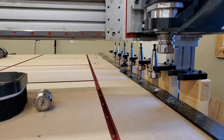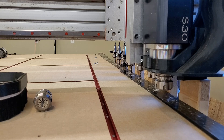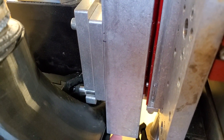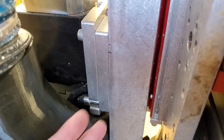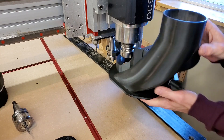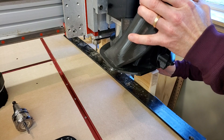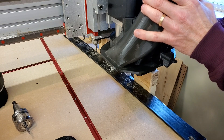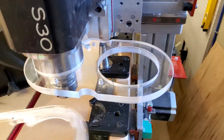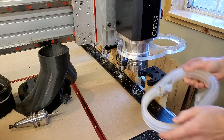As we start to position for the tool holder, I found I didn't have enough clearance and can't quite get down to where we need to go in. There's no way to raise this higher, and even if I dropped the tramming plate down more to lower this flange below the Z structure, the shape of the pathway hits the tramming plate itself. So regardless of whether I lower it, this is still going to hit — it can't go any higher relative to the spindle. It's a shame not to be able to use this. The acrylic boot also doesn't have clearance to go down over the tool holders.